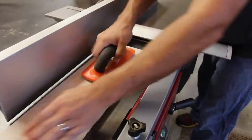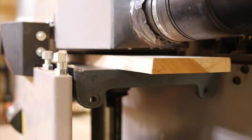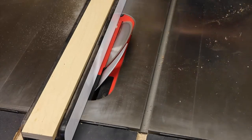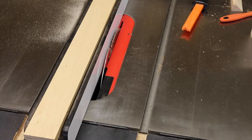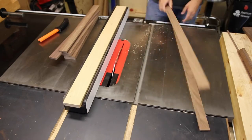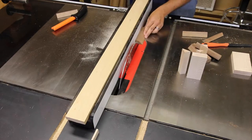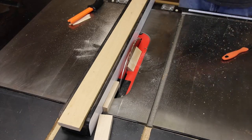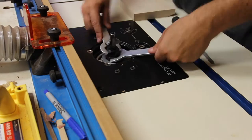Once you put the actual letters in, you take your material and get it squared up — joint one face, one edge, and then plane it down to thickness, because this is going to be cut very carefully. First we're going to take it to the table saw and start working on the letters that can be built using 45-degree miters. We're starting with E. Here you can see we're carefully cutting all the individual 45-degree miters to create the positive pieces for the E. Then we take strips of walnut, cut them down, and within the recesses of the E positive we create all the 45-degree mitered sections to fill in the blanks. The N is relatively straightforward — just three 45-degree cuts with the voids filled with walnut.